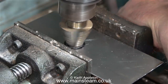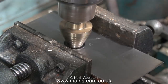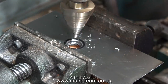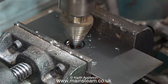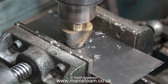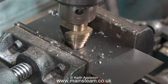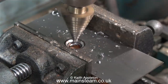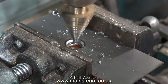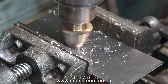And it's good exercise in calibrating your eye. As the hole approaches the edge of what is now a black ring, it's much easier to see whether it's in the middle, and I'm still making very fine adjustments. One more final adjustment — bear in mind I can only make adjustments until I reach the final size. The critical step is positioning the hole cutter on the step before the final one. Now it's exactly in the centre, so I can carry on and go all the way through, removing the black felt tip pen mark. A final check tells me there's a very minute adjustment required, and having done that, it's time to go all the way through.